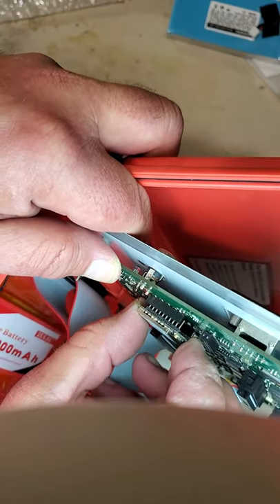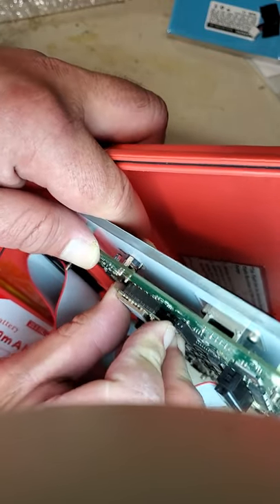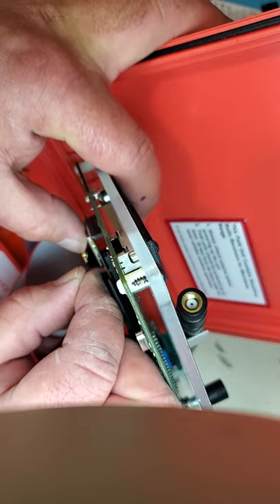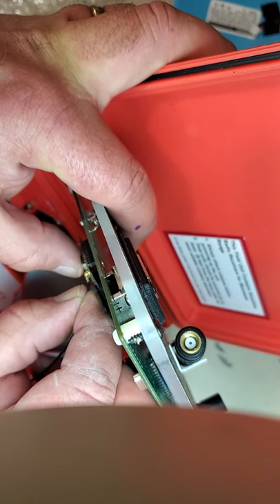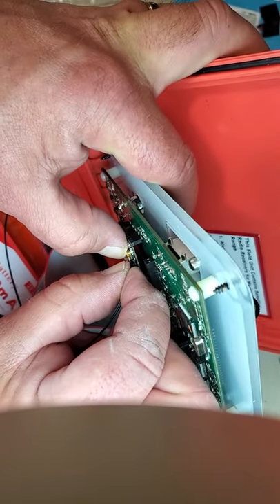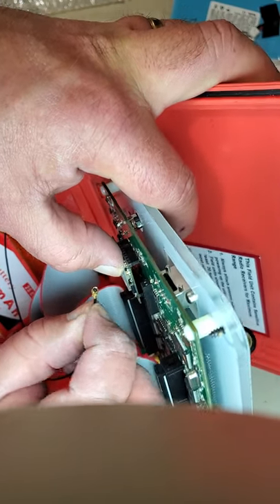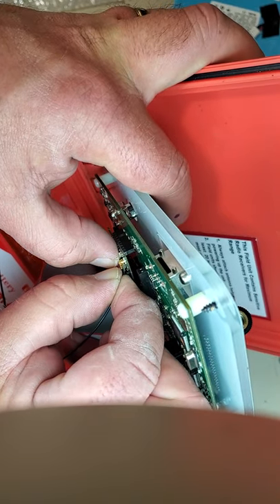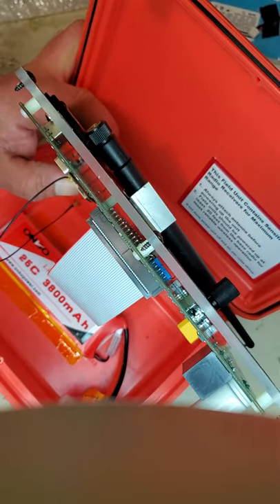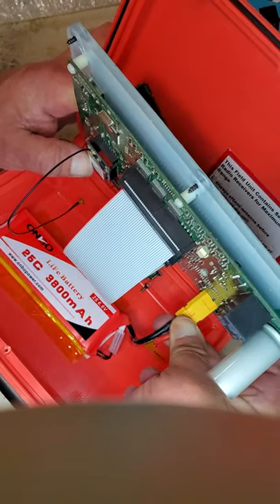Or off the back edge — make sure the pins align, then just push the radio module on. While doing that, the connector may knock off. So if you chose to remove the connector, these are a little fragile — they just have to be directly centered on top. Use a magnifying glass if you don't have great eyes; center the ring on the button on the module and press in until it snaps. Then reconnect the battery — it's also keyed, so it only goes in one way.